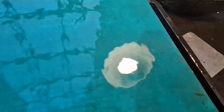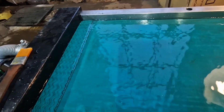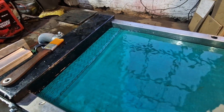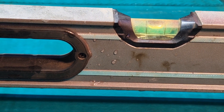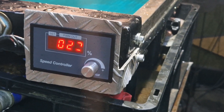We've got a lovely flat sheet now — no bumps, just a lovely sheet of water. I've used an off-cut of the mat, turned it and reversed it, and that just evens the flow of the water out. We're on 22% of the pump speed. We might bring it up a little, but I think we can tilt the bed as we tip the gold on to start with.